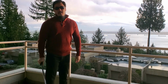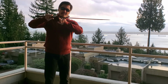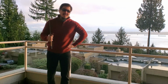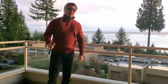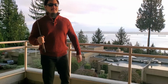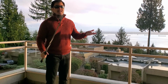Coming back, the tip is more acute than the styles of dao with the tip on the spine. And through the entire length of the blade, it has a single bevel from the spine down to the edge with a nice flat point. This means that it is an excellent cutter despite its relatively slender profile. The edge geometry is excellent, the sharpness is incredible, and it is quite a fun sword to cut with, given its very lively handling and the rigidity and the almost symmetric tip style, making it an excellent thruster as well.